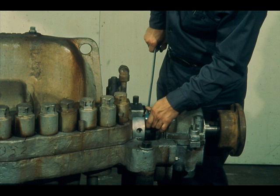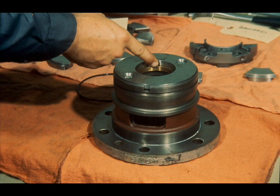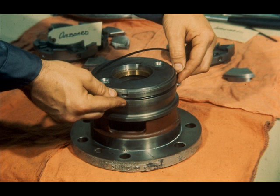The workman found during inspection that it was not necessary to remove this oil seal ring. If it had been necessary, he would replace it at this time and secure it with the bearing adjusting shim. This O-ring prevents oil from leaking by the oil pump bracket and should be replaced with a new one, as the workman is doing now. Once the new O-ring is in place, position the oil pump bracket in the lower half of the bearing housing and replace the bolts in the lower part of the bracket flange, but don't tighten them at this time.